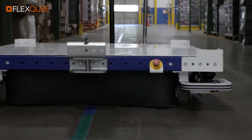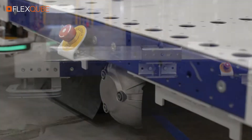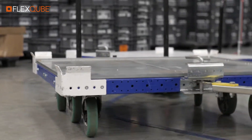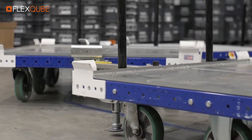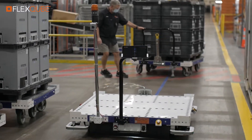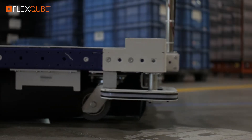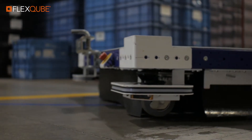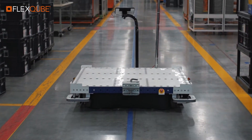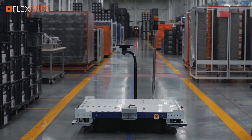The eCart is a modular platform that we're able to automate using what we call smart building blocks. We have LED modules on each corner, a brain module in the center, two drive motors, a swappable lithium battery, a tow hitch for towing, and a tablet stand. You can build any one of our top structures on top of the eCart. The brain module has two cameras, one in the front and one in the back, which perform the line follow application. It's only reading for the color contrast of the tape — not following any magnetic strip or special tape, just looking for that color contrast.